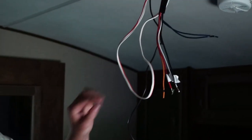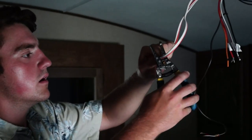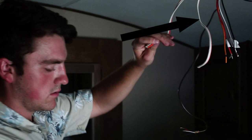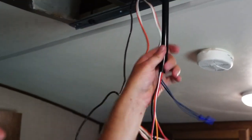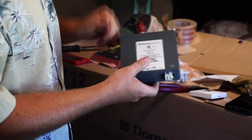It's going to be a little dark — we had to kill the main power coming into the trailer. We also had to kill the 12-volt battery so that we can go ahead and cut the wire so we can splice in the wires needed for the unit to run properly. All you've done is taken the 12-volt wire, cut it in half, and you're going to be splicing the white and white wires together and the orange and orange together later. We've got main power plugged back in and 12 volts back on. In this case, our AC actually had the control board built in — that's what this wire hanging down is. They do have some that don't have it built in; for those, the thermostat kit comes with a little box that is essentially the same. The wiring is essentially the same.